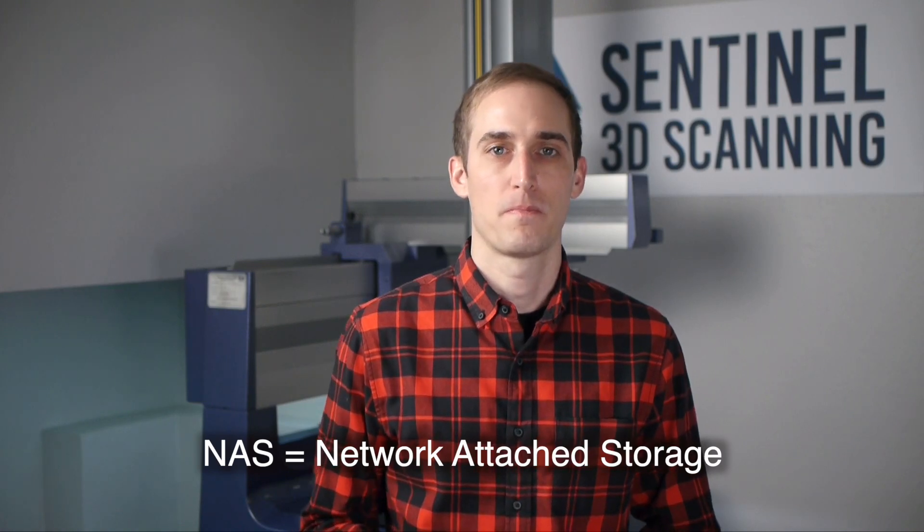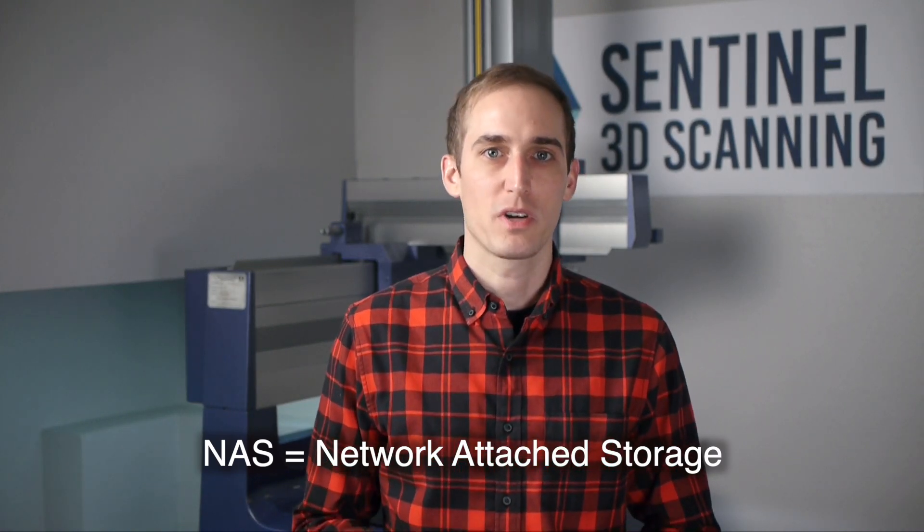To make this idea a reality, talk to your IT folks or look into setting up your own NAS system. Keep in mind that metrology software isn't always super stable. If you go connecting all of your PCs to the outside world via internet and are constantly downloading the latest updates and using your own antivirus software, you may experience some issues. So beforehand, make sure to speak with your software's application engineers first to see if they have any antivirus software concerns, and to see if they have any concerns with the software running on the latest operating system.